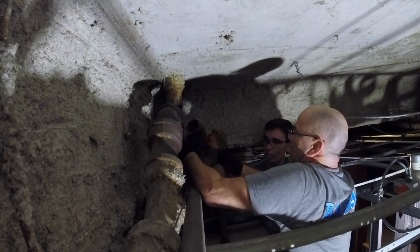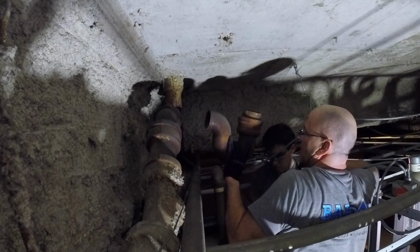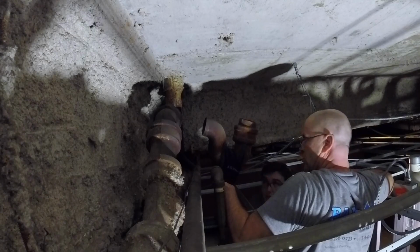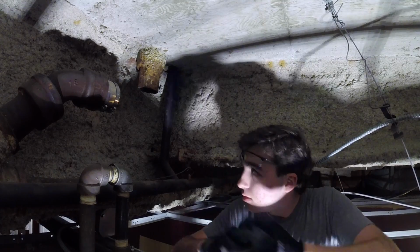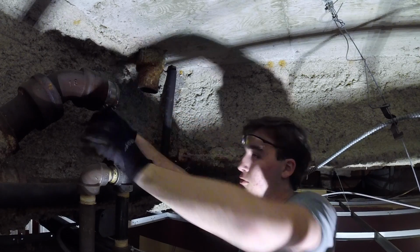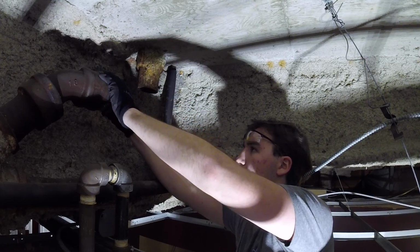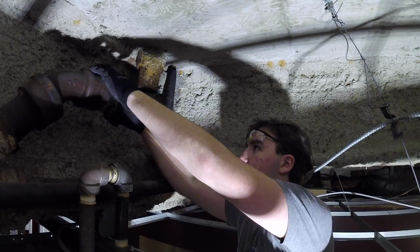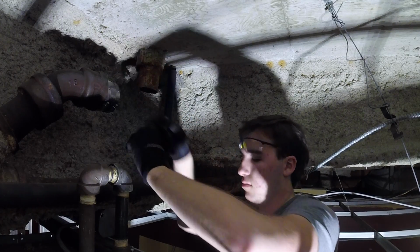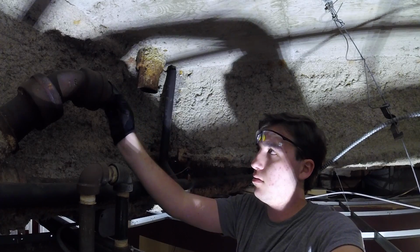We are actually working above the hand sink we are installing and roughing in for the bending area. The drain line will be pumped into an old floor drain above our heads, and right now we're cutting out the old trap above just to make it clear what we are doing here. Here, CB2 is making the connection with a no-hub clamp and a 3x2 bushing that our 1.5-inch drain line will pump into from the sink below. CB2 in action.